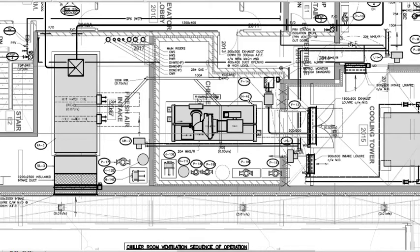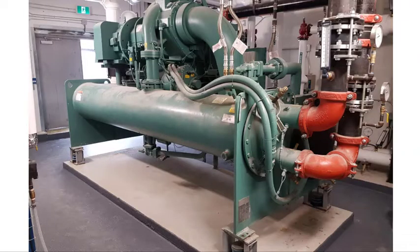As required by the project documents and as recommended by the acoustical consultant, this 240-ton chiller is supported by restrained spring isolators, specifically 2-inch deflection CSR isolators, complete with neoprene pads under the base plates. They were selected for each corner of the equipment based on the weight shown in the chiller submittal, which is about 14,500 pounds.